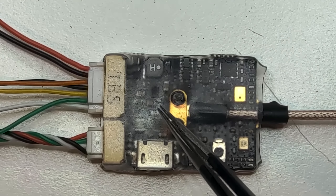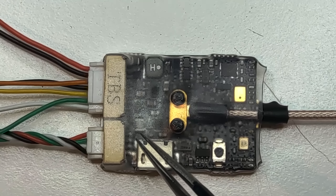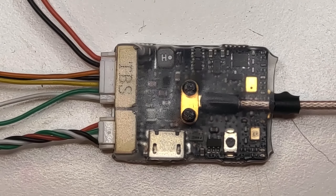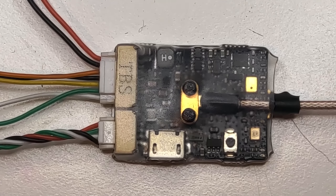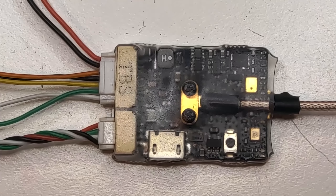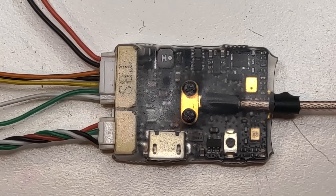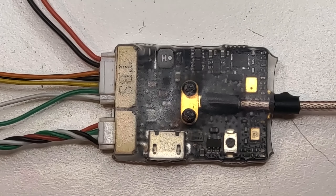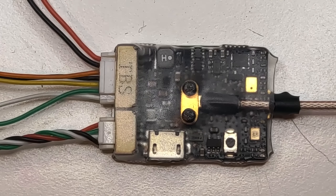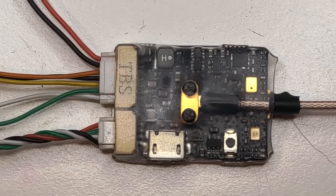On the other side we can see one massive MCU, and of course this is the RFIC generating the RF and modulation. Here we see a bunch of connections: we have the LiPo input which is 6S capable, ground, 5V output for powering the FPV camera, another ground, video, and a serial port they named crossfire — but this port can actually be used as Crossfire and Smart Audio 2.1.